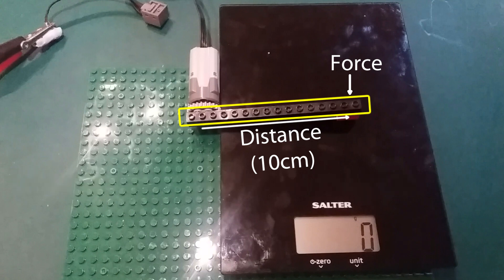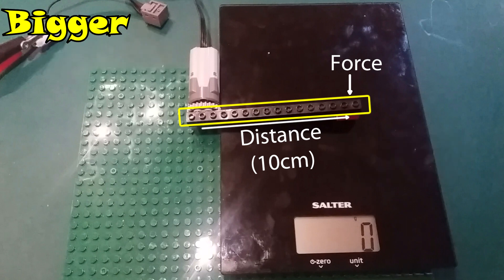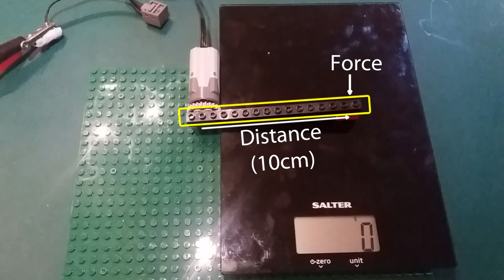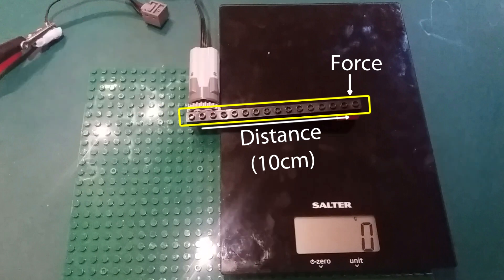If the beam was shorter, then a greater force — due to less leverage — will be felt on the scales. But then the distance you multiply by will be less, and so the value for torque would actually be the same. Cool, got it? Well, even if you haven't, all you need to know is that the bigger the torque number, the better. Oh, and one more thing: force is measured in Newtons, and my scales only measure in mass units because they're kitchen scales — that is to say they're measuring grams, or if you're American or a very old English person, ounces. So the number you see on the scales will be converted to Newton units by some magical trickery called maths. Let's get on with the results.